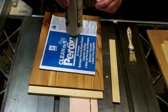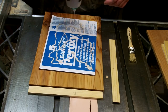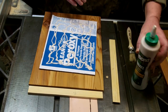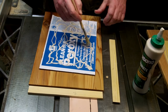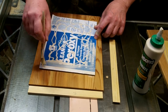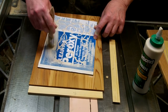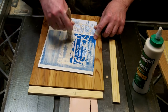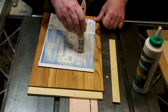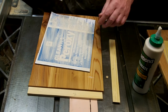Now we're going to waterproof and glue the cardboard. What we're going to use for the back of the cardboard is Titebond Type 3 waterproof glue — it needs to be the waterproof version, which is the Type 3, for obvious reasons. One of the things you want to be very careful about is making sure that the back of this gets soaked very, very heavily with the glue and allow the glue to soak into the cardboard. This is going to waterproof the whole back of the cardboard.